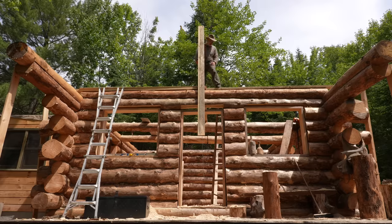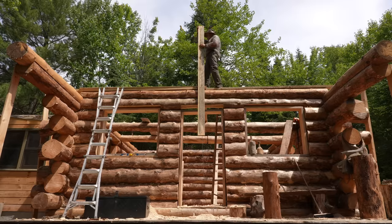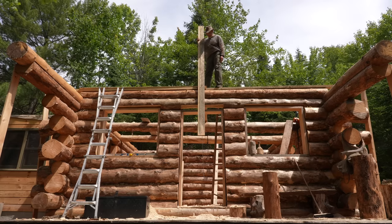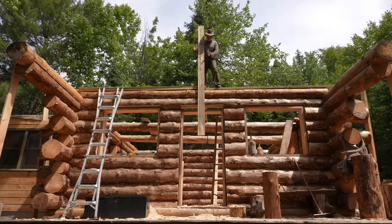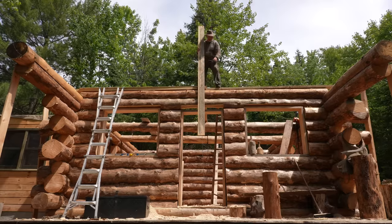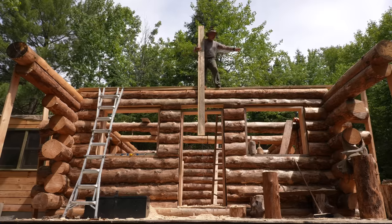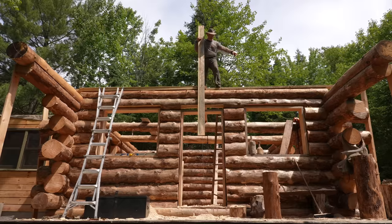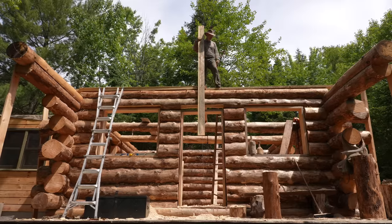That's it. That's the slope I'm going to put on it. It's manageable height. That's what I was checking for. So I'll build a platform across these two center tie beams. I'll have an upright right here, this height, cut off and resting on that top log, the header, and then an upright there and an upright there, which will be half the height of this to zero, so it'll be roughly 3 feet. And that'll carry the two other purlins that are going to be sticking out across the front covered porch.